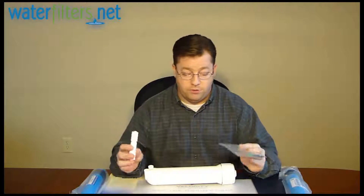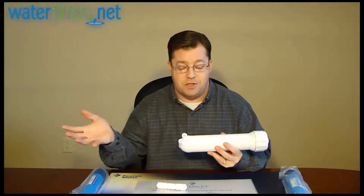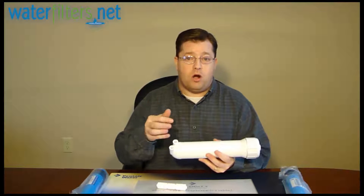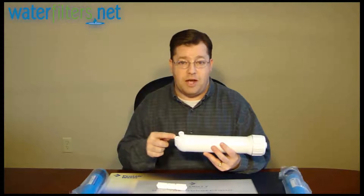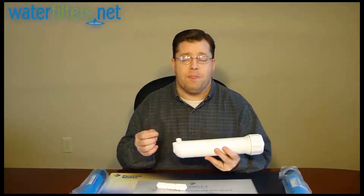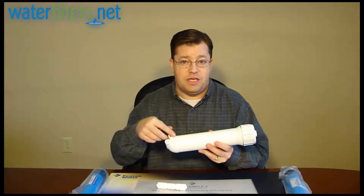The one thing you need to concern yourself with is the flow restrictor on your system. What is a flow restrictor? The two outlets on this end — one of them is a drain line that goes to the drain. If there were not a flow restrictor on that water line, the water would just take the path of least resistance and all of it would go down the drain. None of it would push through the membrane by pressure and end up on the good water side. So every system without exception has a flow restrictor — sometimes called a control valve — on the drain line that exits the membrane housing.